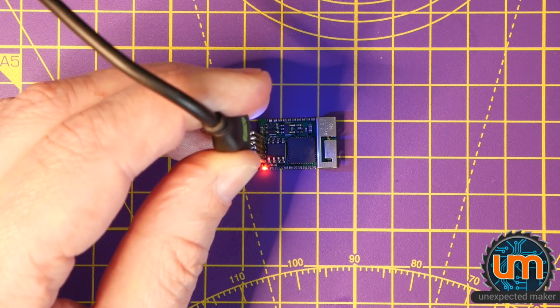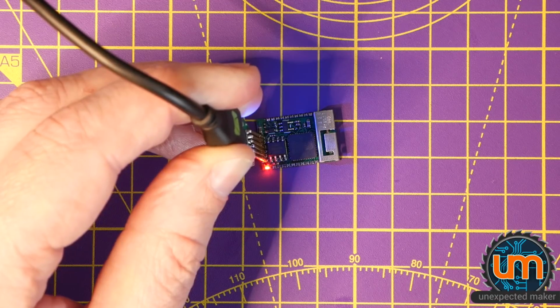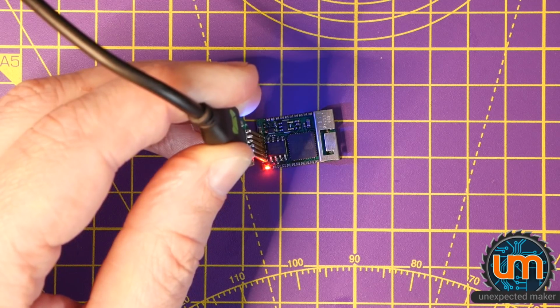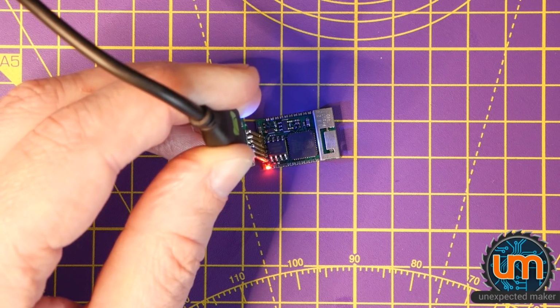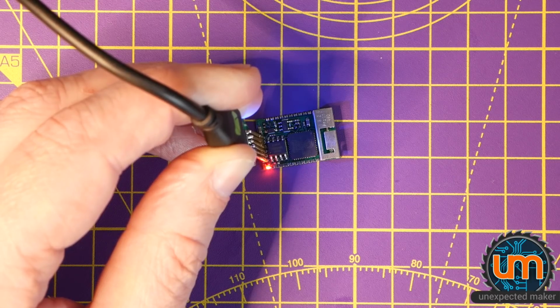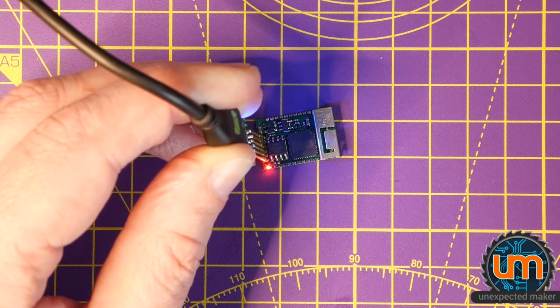Okay, connecting, programming. And this part's great. This part's everything I wanted it to be. Okay, reset, load, entry, wake up was not caused by sleep. Okay, this is working fine, going to sleep. Let's watch it wake up. And wake up from deep sleep. Yep, wake up caused by timer. And it goes back to sleep. So that's working. So just the Wi-Fi scan isn't working.